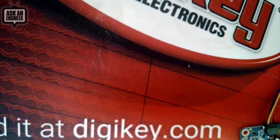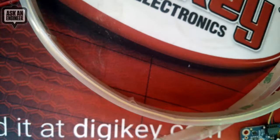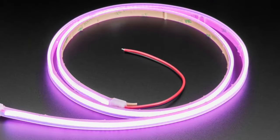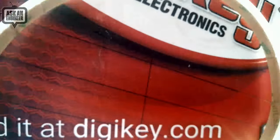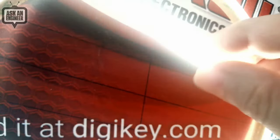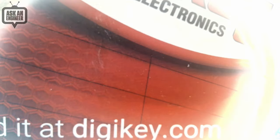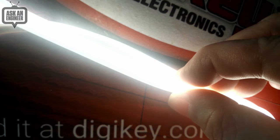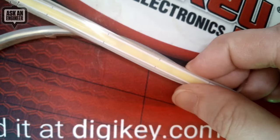I kind of love pink. And then this is the natural white — it's 4,000 degrees Kelvin color temperature. Normally it doesn't flicker — that was just me holding the wires by hand. A nice natural white color. Both of these you drive from basically three to five volts, and they'll draw between 250 milliamps to one and a quarter amps.